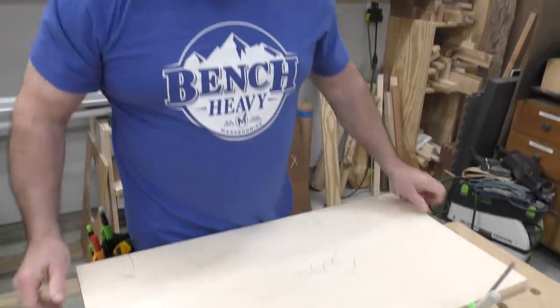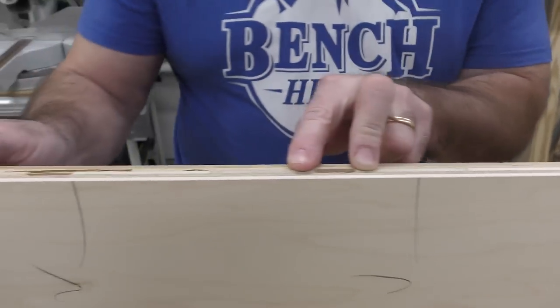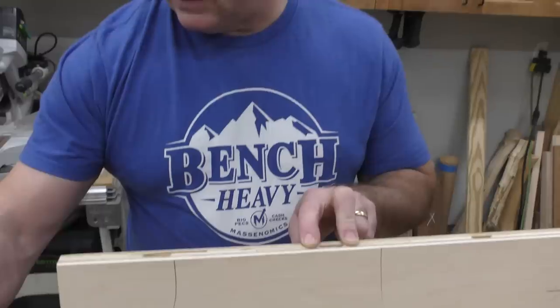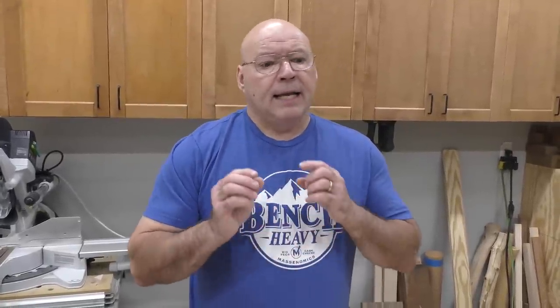As you can see, we've saved all that time and layout. I always tell everybody: what's your time worth? You don't have to mark the boards — the precision is on the machine. This keeps those boards in a glue-up from creeping, or it helps you align edges. There's 6mm of wiggle room, 3 on each side at this setting, or 10mm at a wider setting. And like everything, it's just performing the four laws of the Domino: work off the plate from the same referenced face, plunge from the back of the machine in line, work off the table so the base references the surface properly, and plunge at a steady rate so the bit doesn't chatter as it's cutting.